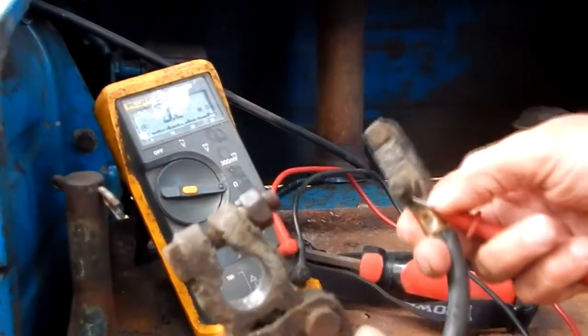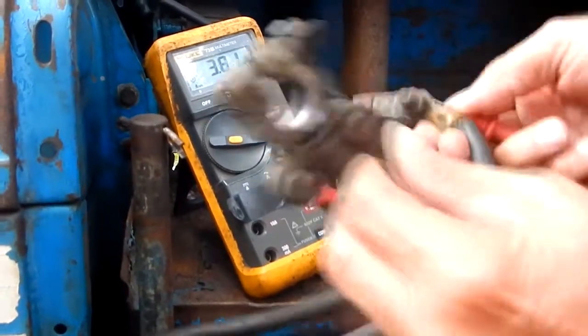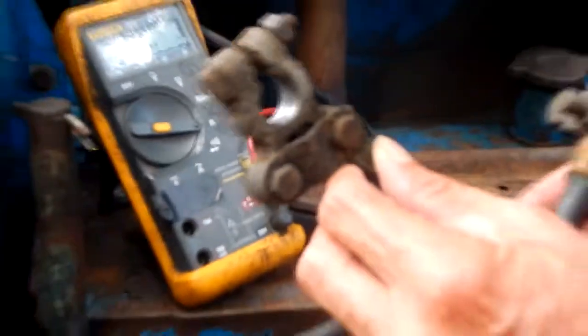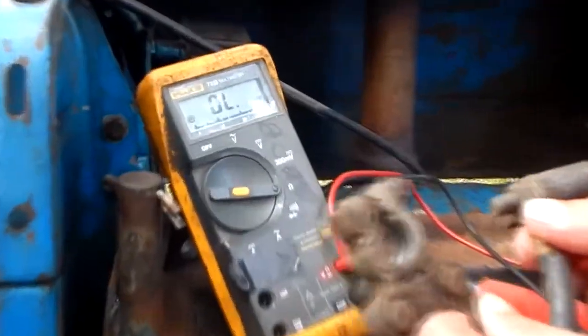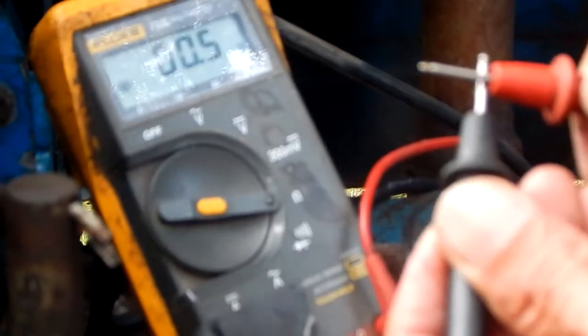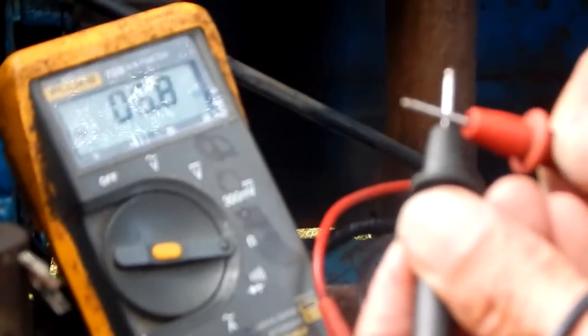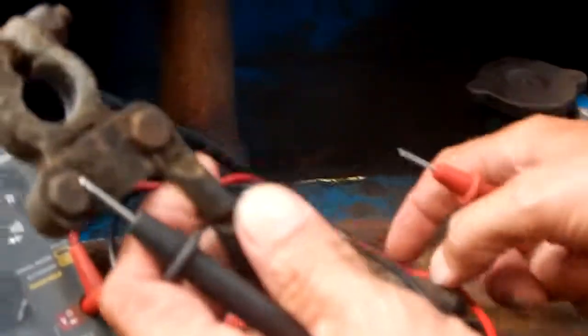My battery is now at about one amp. Let me check my battery terminals and make sure I'm safe. If I read less than open, that means something's on or something's shorted. I'm reading 3.8 — that's mega ohms — that's not true, that's probably reading through my body. Let me change it to ohms and try reading it again. It's reading dead open. If I read any small ohm value, that would mean current is going through a switch — it could be a light, it could be a motor. Also, you've got to test your meter open and closed to confirm the meter is good. I think we're safe to put that battery in. We'll see you at the next video.